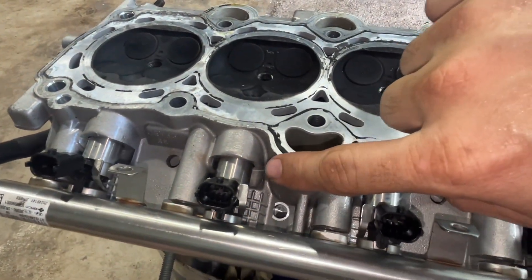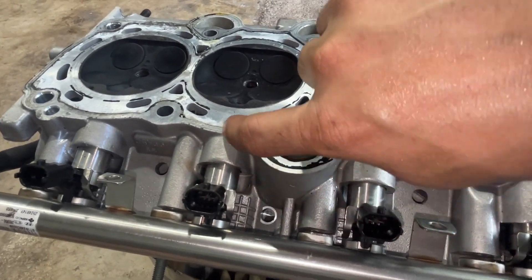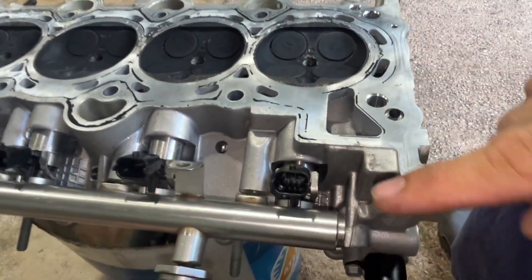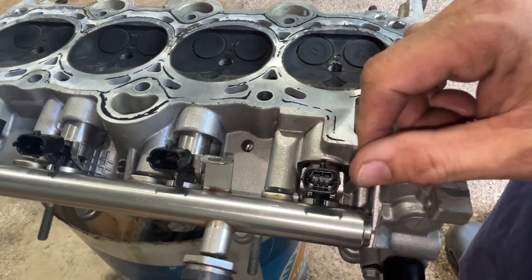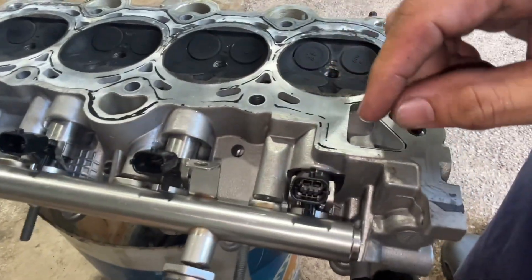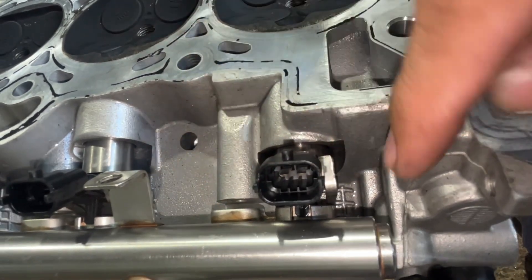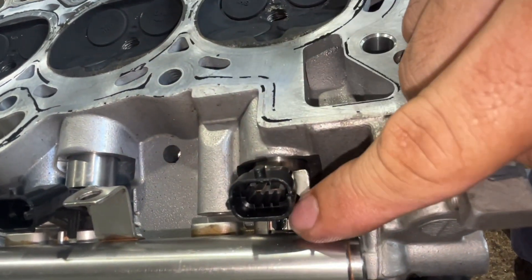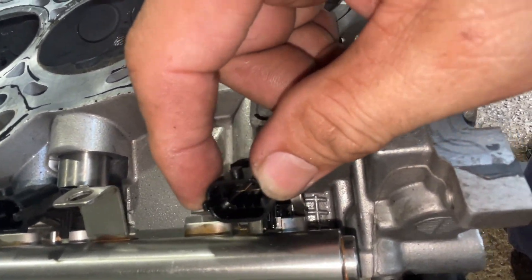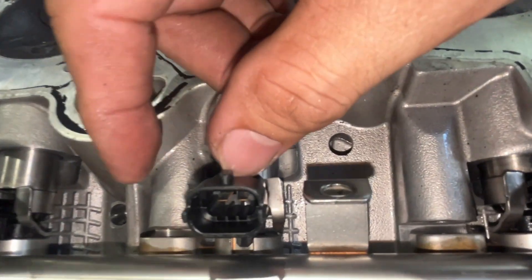Our goal is for the silicone spray to go inside the body here because there's an O-ring there. After I spray this one — actually I sprayed it a couple of times, overnight, to let it penetrate. When I do that, I already try to wiggle it a little bit — not too much — because if you wiggle too much it will snap. See that black stopper there? Just wiggle a little bit.